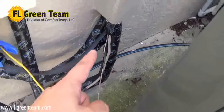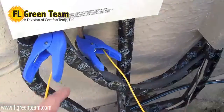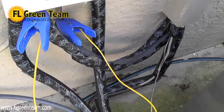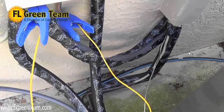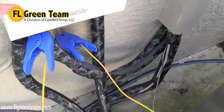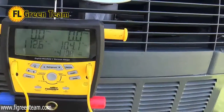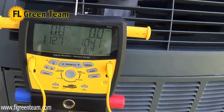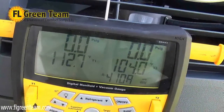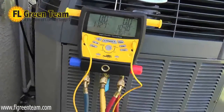Following those two lines through the chase and into the heat exchanger where the two clamps are tied in — those are water lines going into the water heater. The water being pulled out of the water heater is already somewhat hot. The water temperature coming into the heat recovery is 104 degrees, and after being heated by the hot refrigerant leaving the air conditioner, the water temperature coming out is 112 degrees — almost 113.